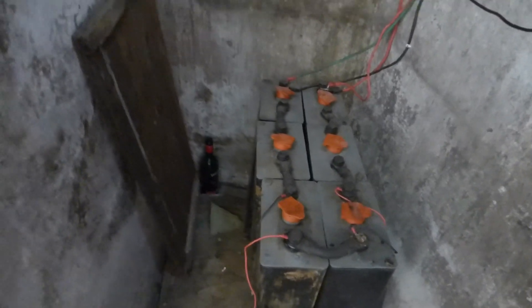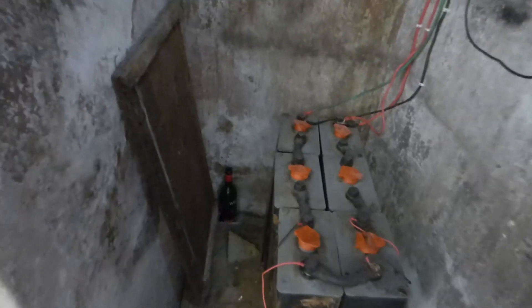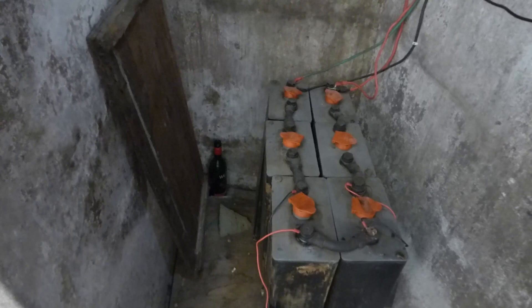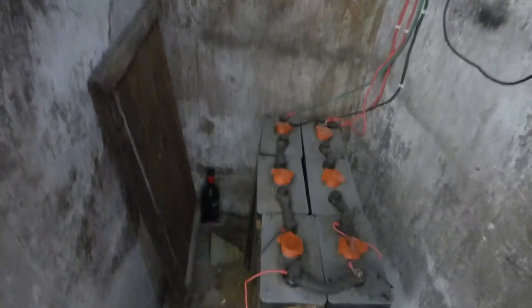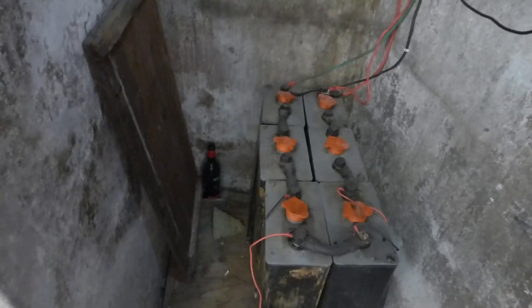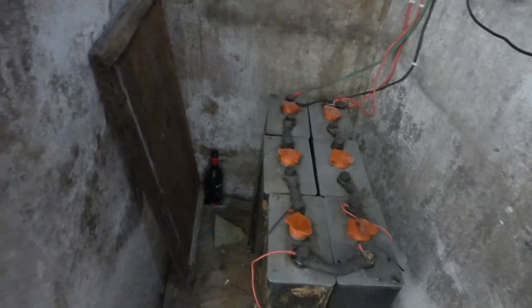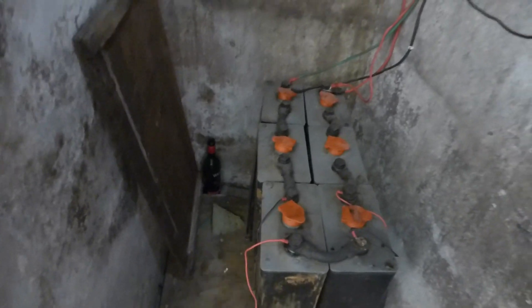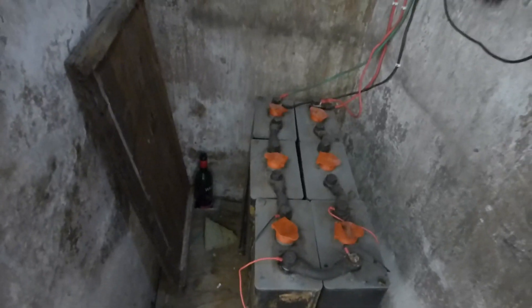With flooded batteries, the acid turns hard — that's what sulfation is — and when the acid gets hard it reduces the capacity of your battery. To prevent sulfation, or to prevent the acid from turning hard, you overcharge these batteries; that's what an equalization charge does. They suggest you do it every 30 days, especially if you're not fully charging the batteries every day. My forklift battery sat for six or seven months with no charge, and we already got them with serious problems. We then undercharged them for about three months, tried for two or three days to charge them, gave up, and went back to our lithium-ion batteries — so there was a very serious case of sulfation.